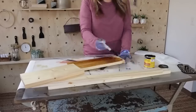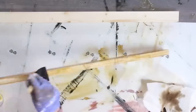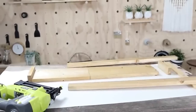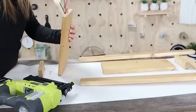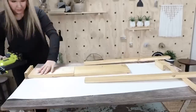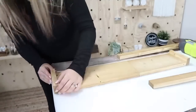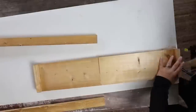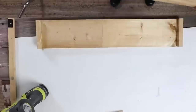Before I put them together, I wanted to stain all of the boards, so I stained them with golden oak. For the two boards in the middle, I'm going to put them together with wood glue. I just bought a new tool — this finishing nailer — and I'm super excited about it. This is the same one that my friend Christina, the DIY Mommy, used and she told me this is the one I needed to get. I'm going to take the finishing nailer and nail in the boards on the side, then nail on the boards to the front and the back.